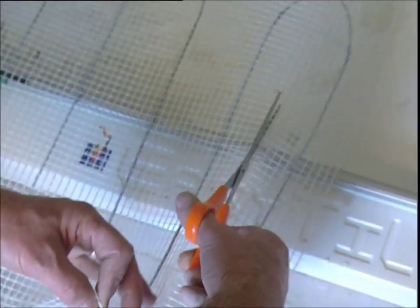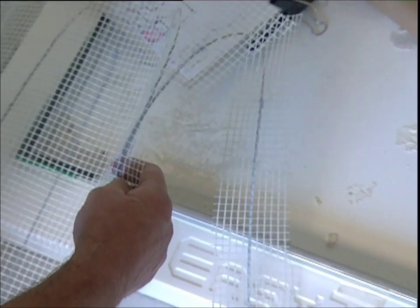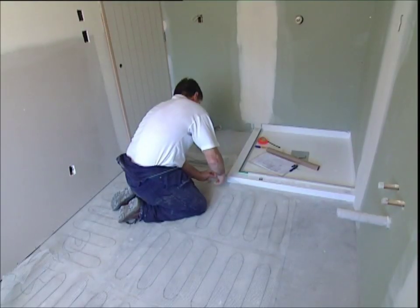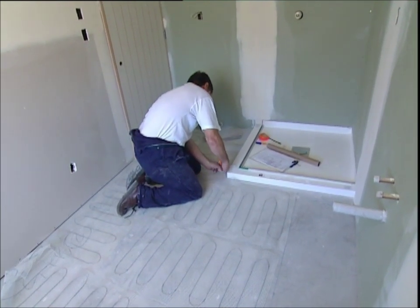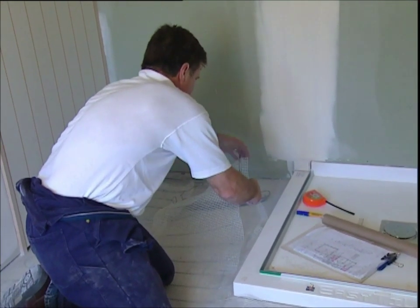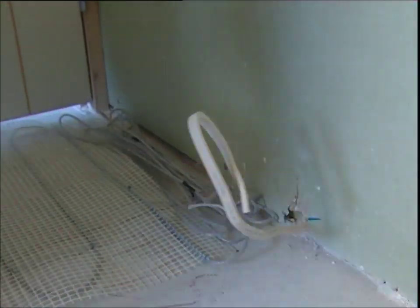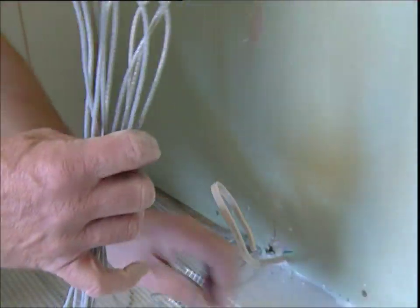For more complicated or smaller areas, the mesh can also be cut into bandage strips to fit and work around those tricky areas. It's very important to note when laying out that the cables should never touch, cross, or be less than 50mm apart. Finish the laying of the cable mesh back at the same point you started from, so that both start and finish cold tails are at the same position close to the draw wire connection point. Note that the cold tail joints — the slightly thicker element portion near the end of the mesh — must remain in the tile area and not go up into the wall once connected to the draw wire.